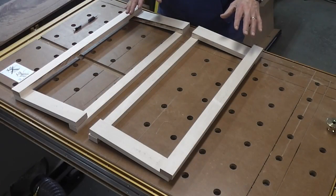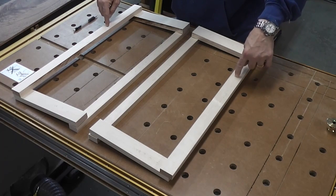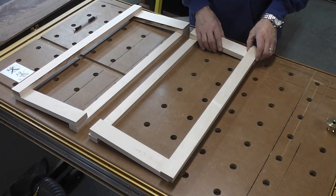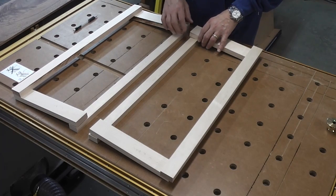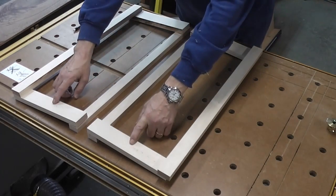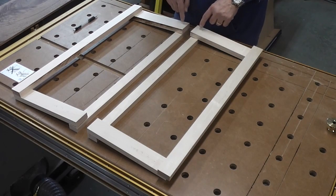Here's all the pieces laid out for the door panels. The way I'm going to do this is on the outside stiles — again, this is all going to be bridle joints. On the outside stiles, the cheeks need to be cut on this side of the bottom and top rails. On the inside, the cheeks need to be cut on the inside rails with the tenon going through here. What I'm going to get with that is there's going to be no interruption between the pieces, so the grain is going to go all the way across. The pieces are matched that way, and there's not going to be any stile to interrupt that grain flow.